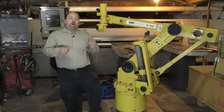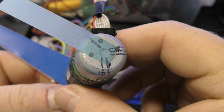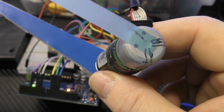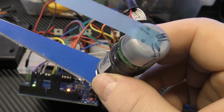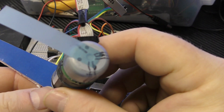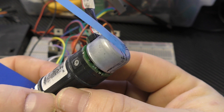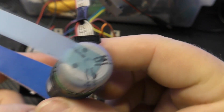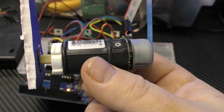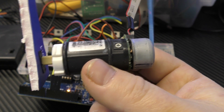The machine that my friends have — it's a big computer-controlled wood saw, a panel saw — it'll cut wood panels into smaller pieces, computer-controlled. When it moves that panel around, it does that with AC servomotors. So AC servomotors are very common in industry, and especially robotics. And so we're just playing around here by basically converting a brushless DC motor into an AC servomotor.